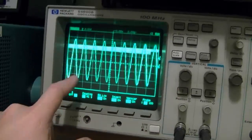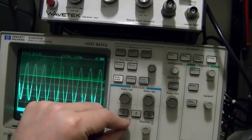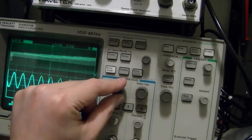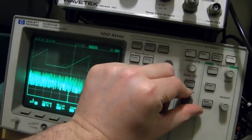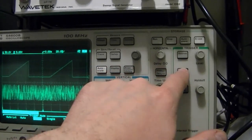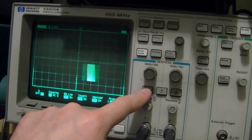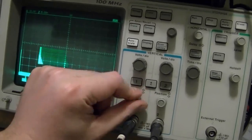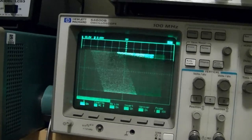What you see on this axis is a drive that you put to your oscilloscope. So when you use a sweep generator, you do not use it in this mode. This is just a convenient way to see what the output signals of this thing look like. What you use it in is XY mode. So, it's my X-axis, stretch it out a little bit. And there is my Y-axis.